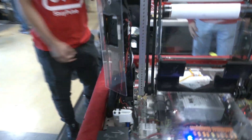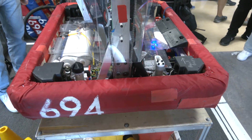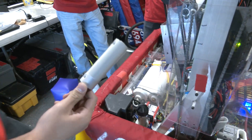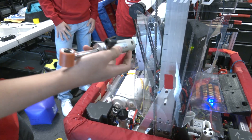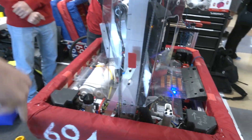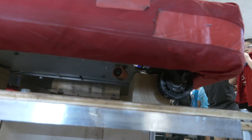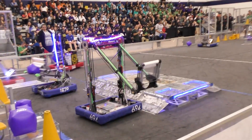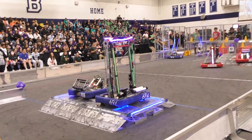So these are called our grippers, and they're kind of the linchpin of our end game. Basically what they are are pistons with very frictious material attached to the ends. Here's a version not yet connected to the robot — it's just a pneumatic piston with sushi rollers attached to the end. The sushi rollers don't roll; they're just there to keep a point of contact with the ground. Once we're onto the charge station, they fire into the charge station so that even while it's tipped, the robot won't be rolling at all.